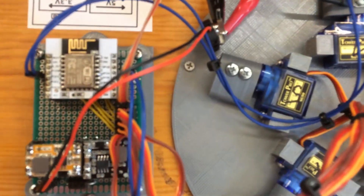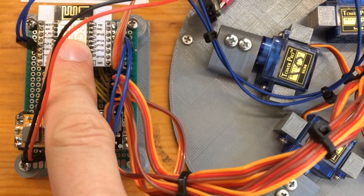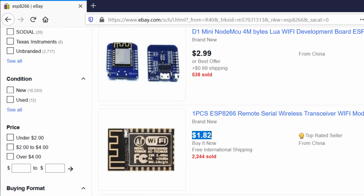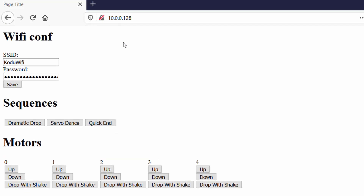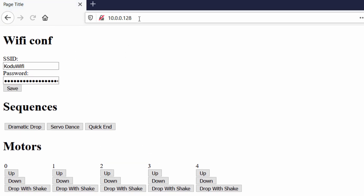Okay, now let's see how it works. This little board here, the ESP8266 WiFi module, controls everything. It's super cheap and we don't have to worry about communication wires since everything works over WiFi. I have created a simple web page on the microcontroller that can be accessed by its IP address.